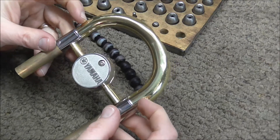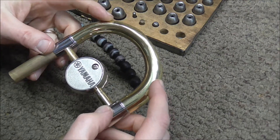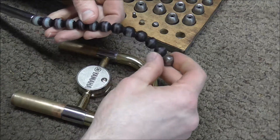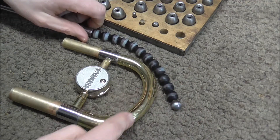In another video I removed the dents from here to about here with the mandrels. The mandrels cannot reach around the curves on instruments, so that's what this tool is for. This tool can go around the curves and it can push the dent balls through the tubing.